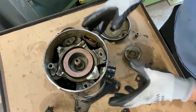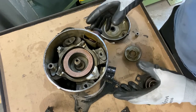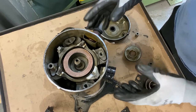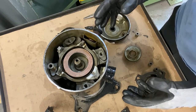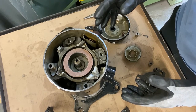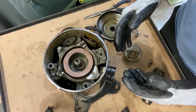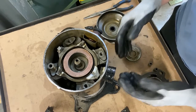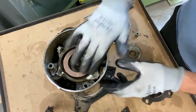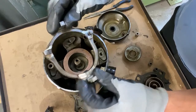So this compressor failed from contamination. Can anyone tell me what they have to do to fix this? Or what they should have done in the first place? Pulled a good evacuation. Down below 500 microns holding, down below 250 microns and held. Other things you want to check is this is the Oldham coupling. See, make sure this is not broke.